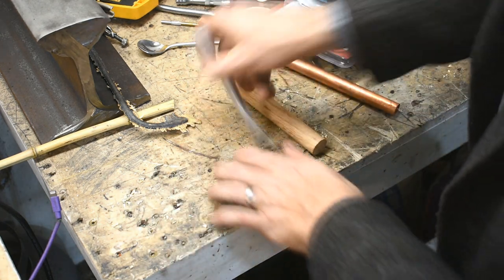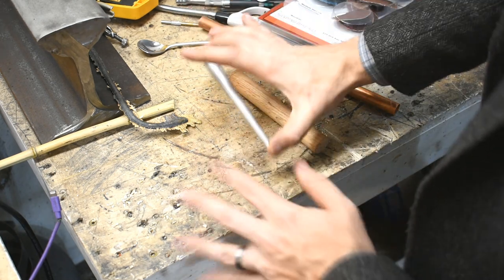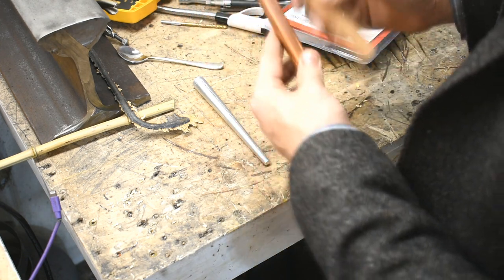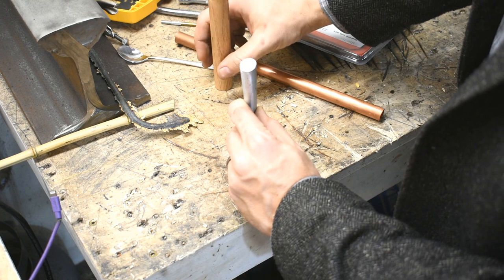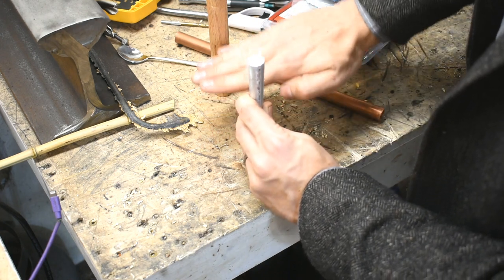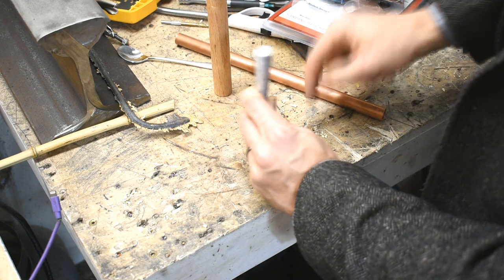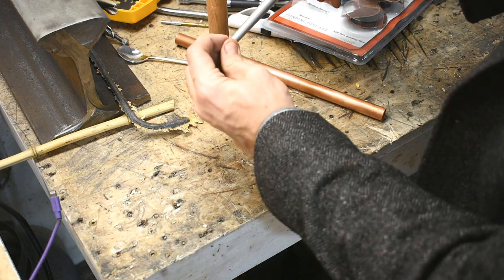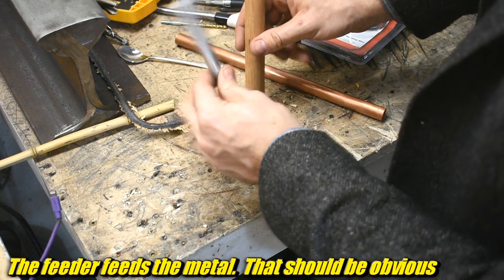There's a basin that this fits in and some other parts, and I don't have that yet. So watch SW Dweeb's video where he makes this — he will show you all about it. Now, why use this? I'm still going to be using these two, but probably as feeders. This is where I'm going to pour the metal in, and the other one will be somewhere else, probably over a very thick part of the casting because that will be the last to solidify. I'll pour in here, it will run through the casting and fill up the feeder. As the casting is solidifying and cooling, the metal wants to shrink, and the feeder will feed in. You don't want to use a long tapered sprue as a feeder because the skinny part is going to freeze first, so none of that metal will be able to feed in. Sprue and feeder are two separate things.